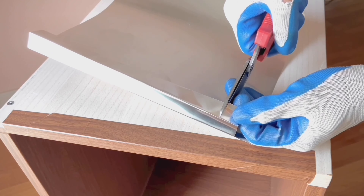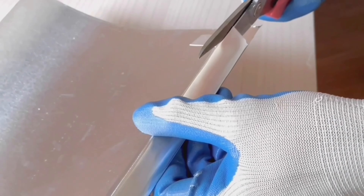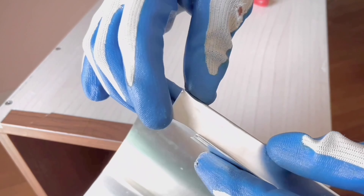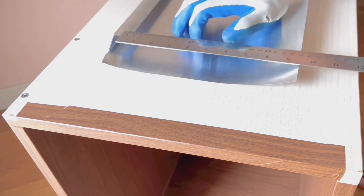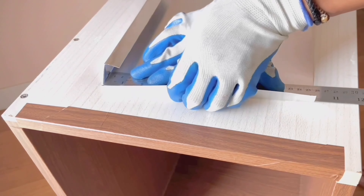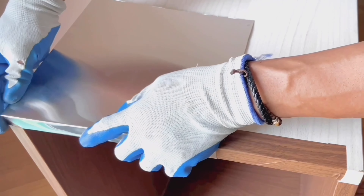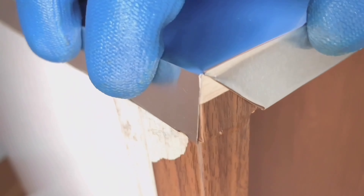Then I just cut some more at 2 centimeters, but this time I'm not gonna cut over the bottom of this U-shape — I just leave it like a triangle there. After that I'm just folding diagonal like this, so now I've got a nice fine line to the corner. And again I'm bending the sheet 90 degrees to fit the other side. So now we've got a perfect metal sheet covering this corner and covering inside of the storage as well.